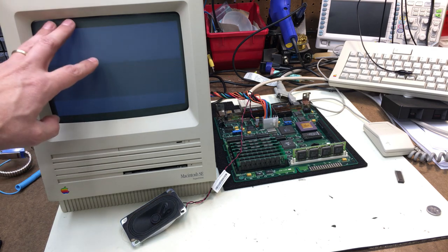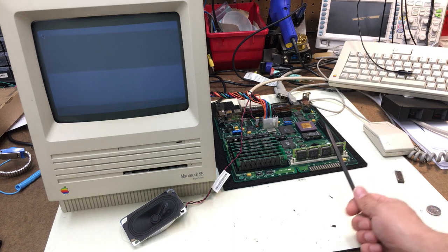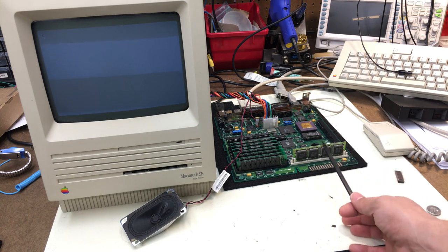Aha! Jail bar patterns are gone. So now we're going to dig in a little bit further. I can tell you that during the diagnostic process, I didn't really film it because I tend to just get going and play around with stuff, that there are issues with the bus on this machine.